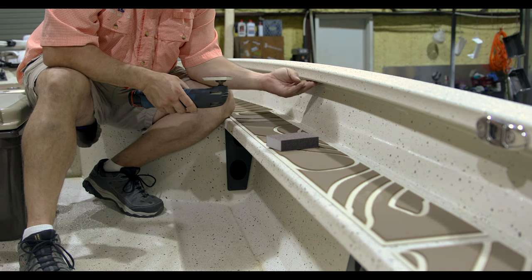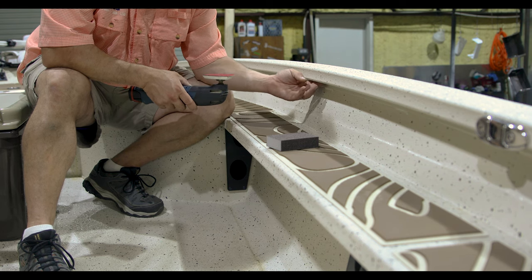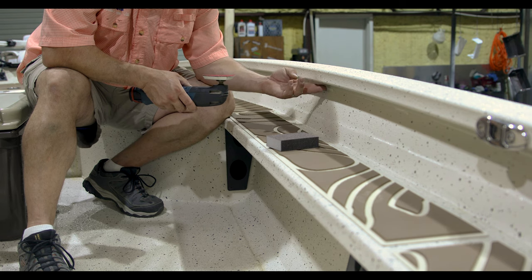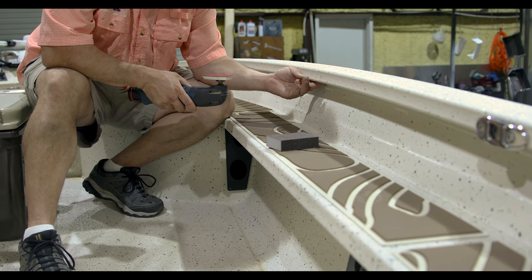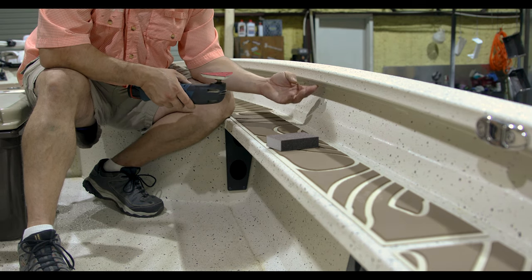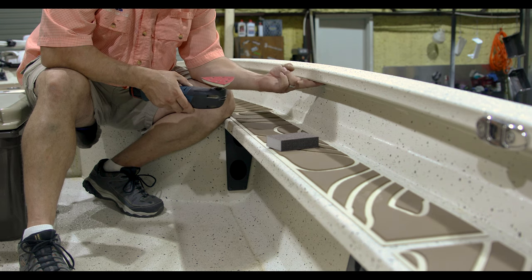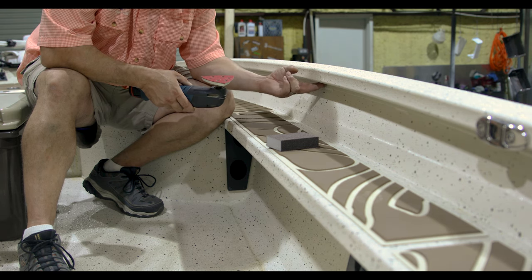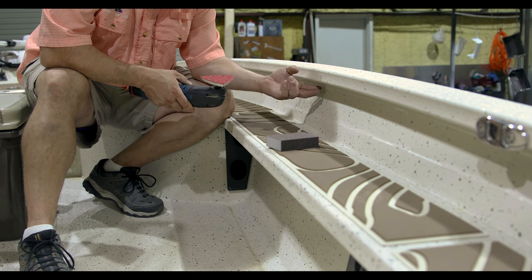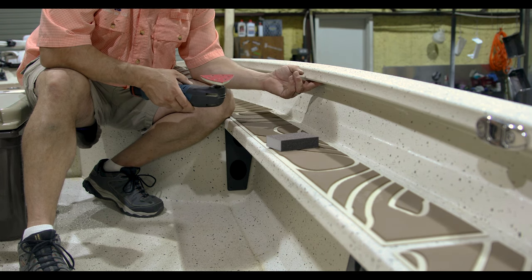But what we have to do is get this smooth. We have to get most of this texture off, even if sometimes it will go to just raw aluminum very easy, or fiberglass, whatever case might be. But we want to get to a sturdy material. If we adhere our snake tubes to a substrate or the first material and it doesn't even stick to what it's sprayed to or painted onto, then it's just going to come off. So this is a very, very crucial step.